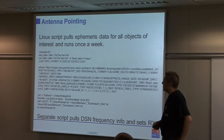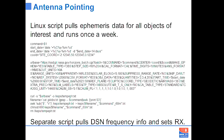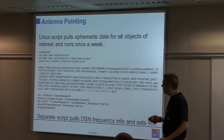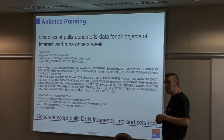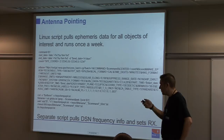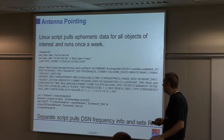For the ephemeris data, you can go to the website and type everything in, but it's far easier to write a simple script that automatically does this once a week. It has a list of things I'm interested in, processes it, spits out the data, dumps it on the network drive, and the machine that steers the antenna takes this data and sets the receive frequency — so it's almost fully automatic.